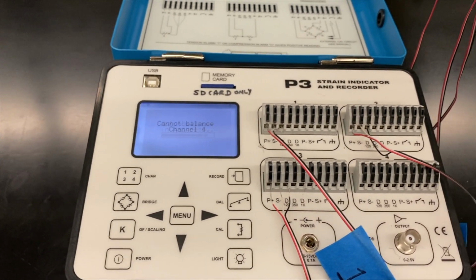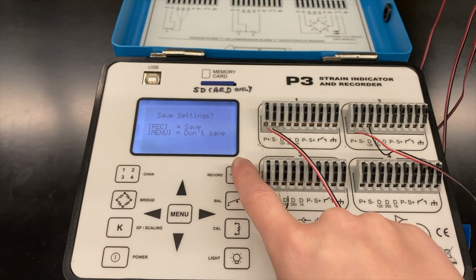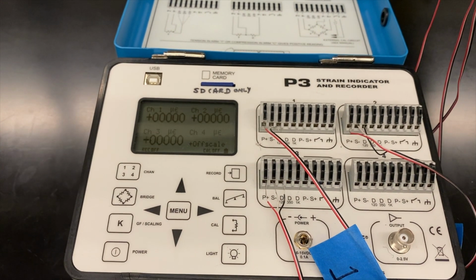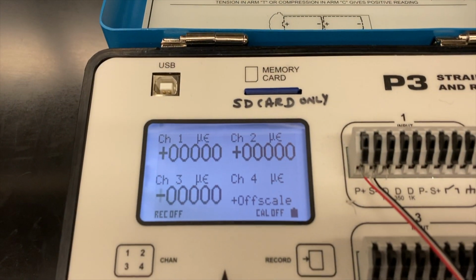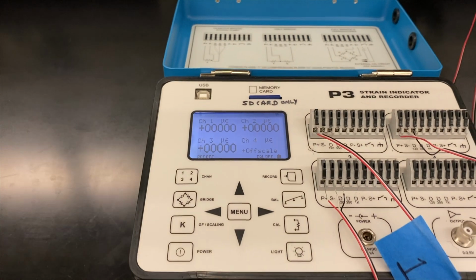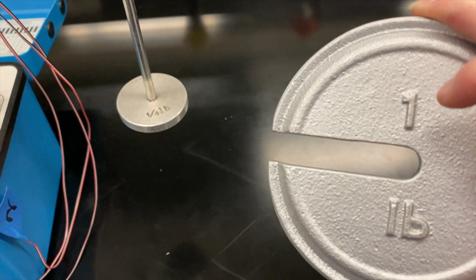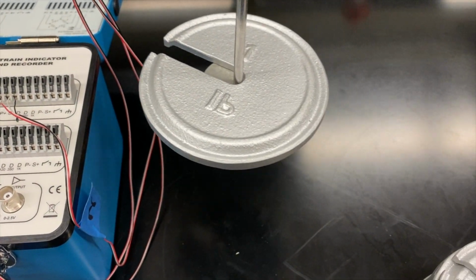Once we know that our quarter bridge setup is indicated for each of our channels, we can balance our test system. It'll say it can't balance channel 4, and that's because we don't have any wires plugged into our channel 4 setup in order for that gauge to be identified. So now we see that we have all of our strain indicator values set to 0, so our strain state is set to 0.